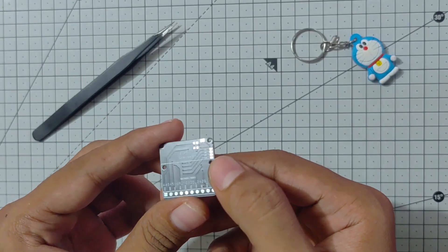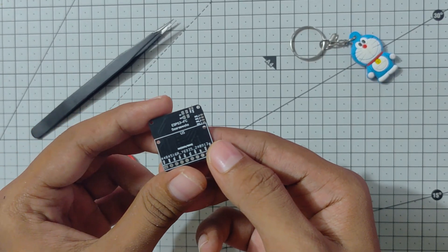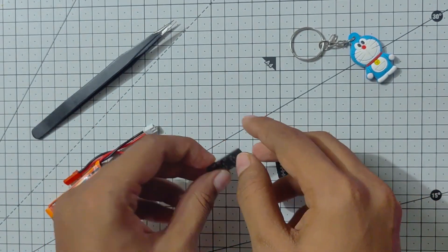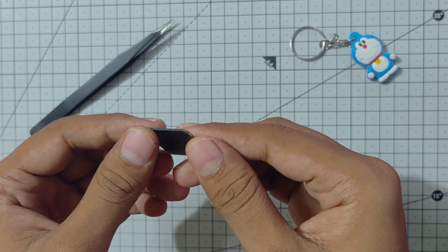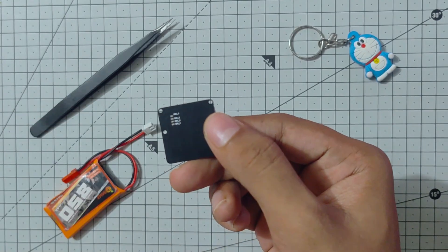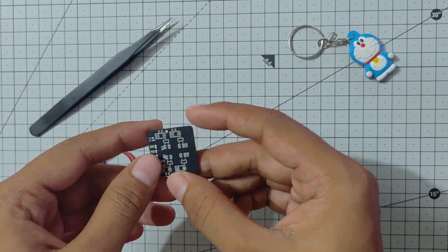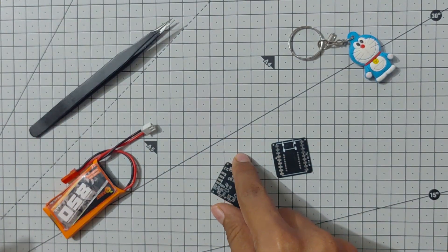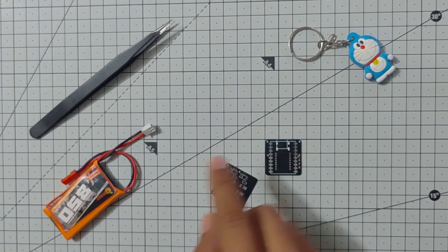This is the new flight controller board which uses the ESP32S3 mini and the MPU6050 IMU for the gyro. And this here is the all new ESC PCB. The good thing is this PCB is not only limited to the drone — you can also use it in other projects where motor speed is variable, and you can vary it by signaling PWM to the pins underneath the PCB.